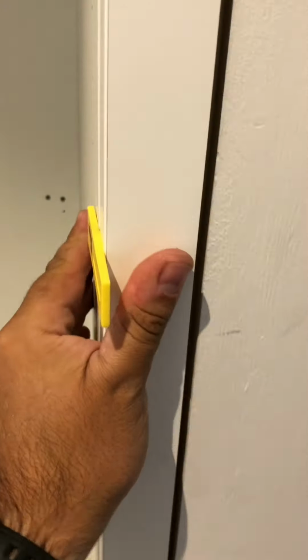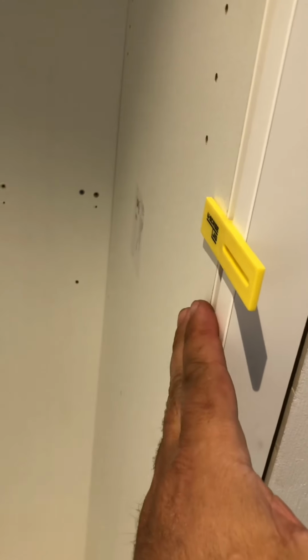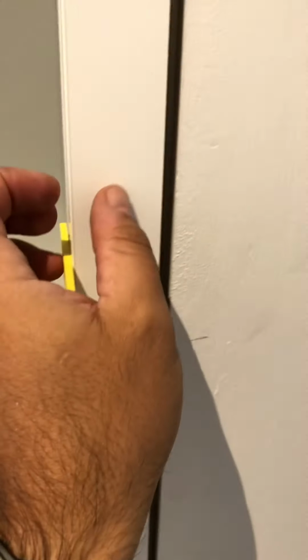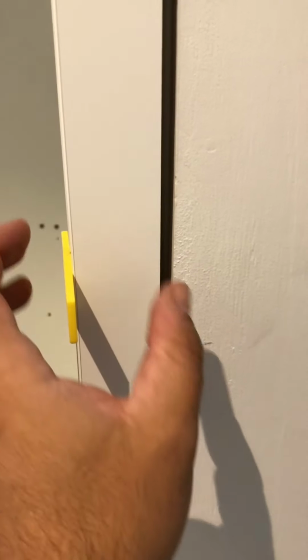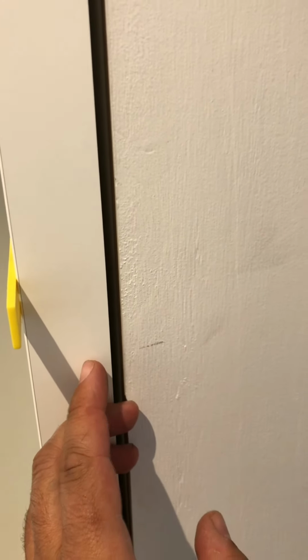And basically this, if I can line it up, will make your filler flush with the inside of the cabinet, which gives me a 16 mil offset of my filler. So all I have to do is measure from here to here, make sure it's 16, set my scribe tool, and away you go. Just give me a minute, let me set this in.